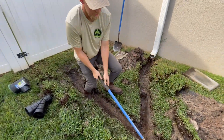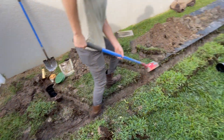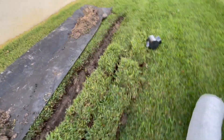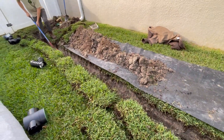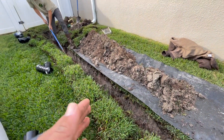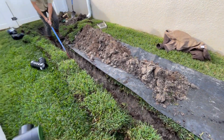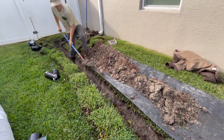Joe's putting in some work back here — already got the downspout dug, got the start of this line dug, and the catch basin right there at the drip line. He's digging a little bit wider so we can drop in this perforated pipe. We're using perforated pipe here because we have better soil than usual. Normally we're dealing with solid clay, but this water actually percolates a little bit through here, which means there's subsurface water, which is why we're dropping that in.